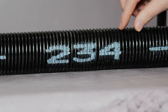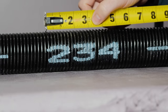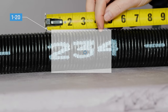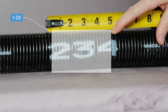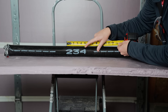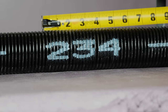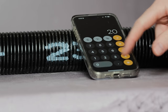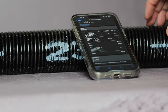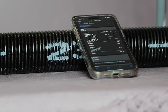To find your wire size, count 20 coils and measure that span. For example, starting at the '2' marking, I count to 20 and I'm at approximately 4.75 inches. So I divide 4.75 by 20, which equals 0.2375 — within a few thousandths of the actual measurement of 0.234. You can do it by 10 or 20, or measure in different spots to confirm. This does require the spring to not be under tension.